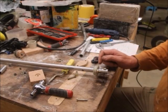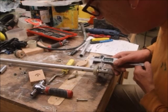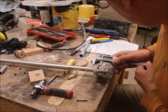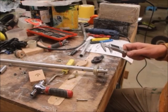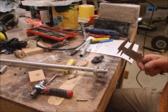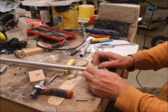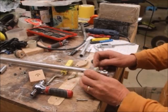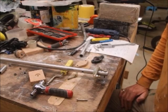So I'm going to step to face the bearing. It's 18.3mm, so it's kept the spacing to within a millimetre, and the millimetre is in the direction that'll put my bell crank 0.3mm further away from the firewall, which can't be a bad thing. I'm quite pleased with that. Now I have to decide whether to make another one or install this one.